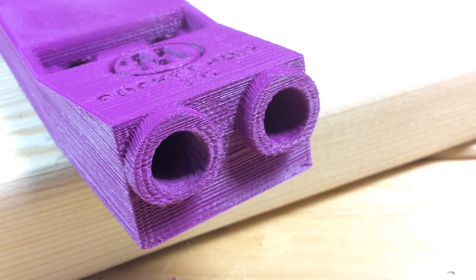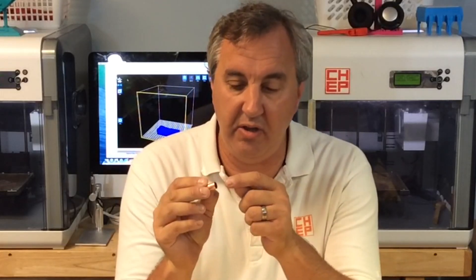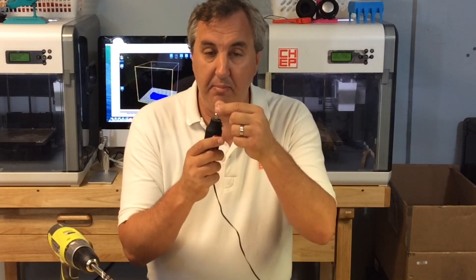I needed to add metal inserts to guide the bit, so I'm going to use these copper couplings for quarter-inch pipe. The problem is they've got a little nub inside so when you put the pipe in it stops about halfway, so I'm going to need to grind those down using my die grinder with a sanding disc on the end.